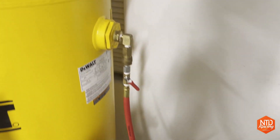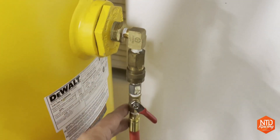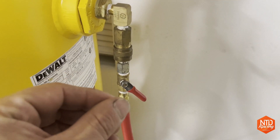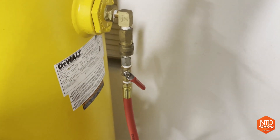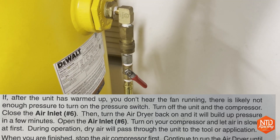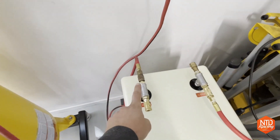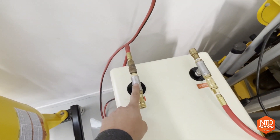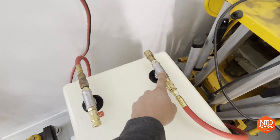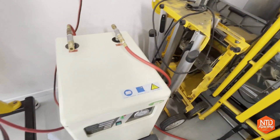Let's look at some of the fittings. Off the compressor I have a three-quarter inch NPT, which goes down to an elbow and a quarter-inch NPT into the hose. Before the hose I have a valve that allows me to not only turn the air on and off but also regulate the rate at which it goes into the dryer. There are some modes where if the dryer isn't building up pressure, you turn off the air, run the dryer, then slowly let the air in — this valve allows me to do that. A six-foot hose goes into the top of the air dryer, and then air can either come out undried or out through the dried-air side that goes into the back of my Razorweld for the plasma table.